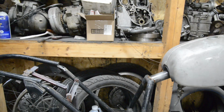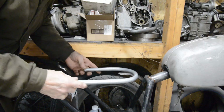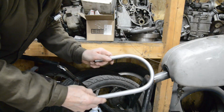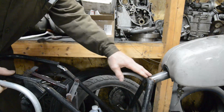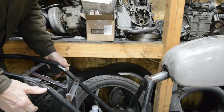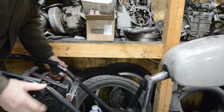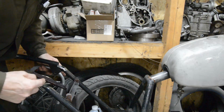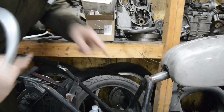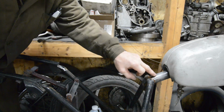Now if I'd known that beforehand, I actually wouldn't have put this crosspiece in, because I could have put that right into there. But what we're going to do is just notch that in there slightly. I could fit it on at the sides, but the whole point of this design, or the way I make the modifications, is the upward force, which isn't much of course from the suspension units, because the suspension units are supposed to take the upward force. We're triangulated, so that force goes into there, and then that goes up to the headstock and everything's good. So I don't want the forces pushing at the side, I want the forces pushing right onto that, because then they go straight into there.